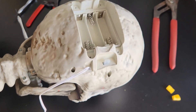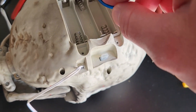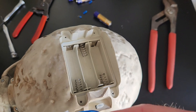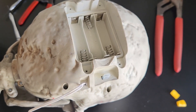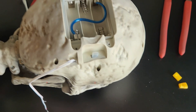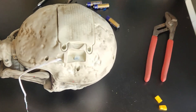Step four: take a jumper cable — a little piece of speaker wire. As you can see, I've crimped on a couple of crimps here. What I'm going to do is sneak it down behind the battery terminal on one side and make sure you go all the way to the cross corner on the other side to close the circuit. You can solder this — even if you don't have crimps you can just shove the speaker wire in there. It doesn't have to be a work of art. Get it in there nice and tight, then put the back of the skull on and move on.